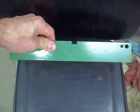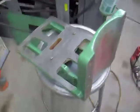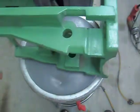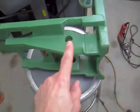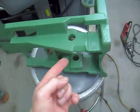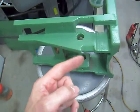This thing is like 25 pounds — it's heavy. And this joker here is fairly sizable and heavy too. Sidebar: those two holes are for a counter shaft when you have the internal grinding spindle for doing ID grinding. A shaft goes in there and a pulley or something goes on there, and a flat belt goes to the internal grinding attachment which bolts to these T-slots.